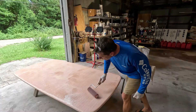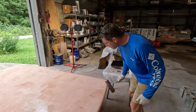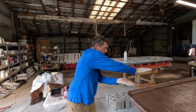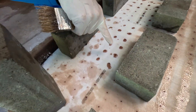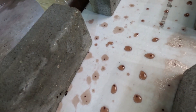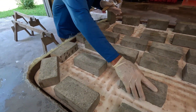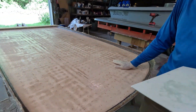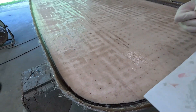We have wet out our mat and we are putting an extra heavy coat of resin on our core. We're going to get this piece of core, flip it right over, and bed it. Look at all these bricks we laid out — come in tight, see how you got resin oozing out of almost every one of those little pores. We'll do it real systematically — every brick.